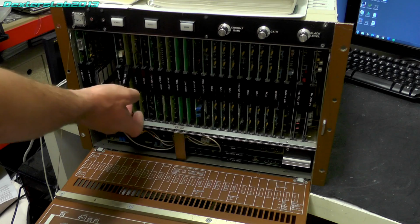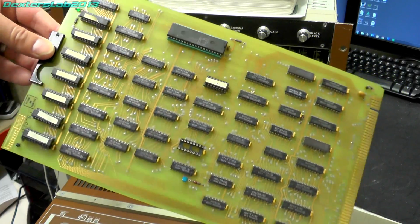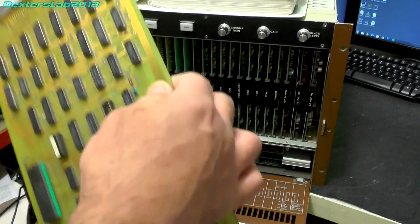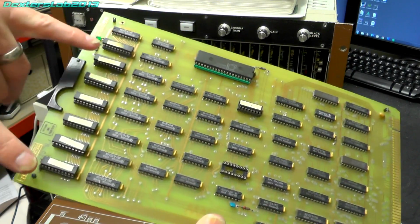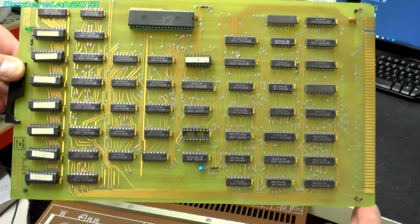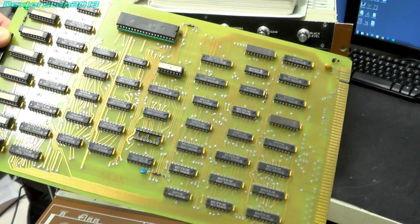So the next card along is the disk sequencer card. Now this is a card that we've been taking a fair amount of look at, because this is essentially the interface into the SMD drive, and this actually uses an AMD 2910 bit slice processor, and has these ROMs, programmable devices here, which hold a bit of code which the Paintbox then instructs to execute, which then does all the interface stuff with the hard disk. So it tells it to step the heads one track ahead, read sector X, and all that sort of stuff.